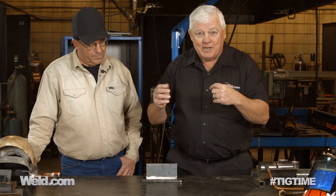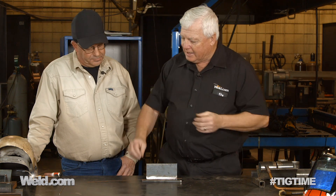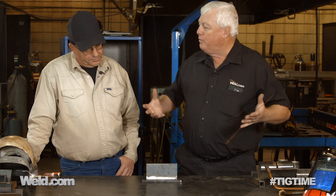When you get into your small diameters and you try the same test that I did, you start your arc and the wire just burns back. So I came to the college here, and come to find out there is a lay wire technique that's out there, not used very often. I solicited Bob's help to talk about this technique. Bob, not that you agree or disagree, have you ever heard of the lay wire technique?